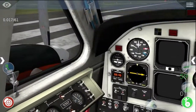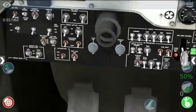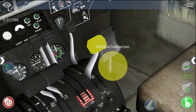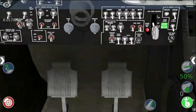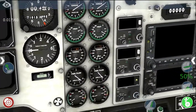Now we're starting the left engine, following the same steps as before. We turn engine ignition on, wait for the turbine to get up to 12% or above — which it has. Now we set the condition lever to low idle, wait for it to get to 51% or above, and then go up to high idle. There's 51% — engine set to high idle. Ignition switch is off, and now we wait for the engines to stabilize.